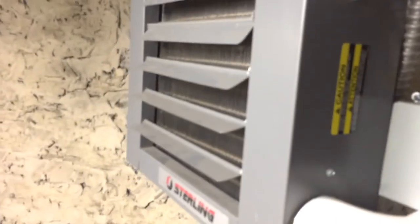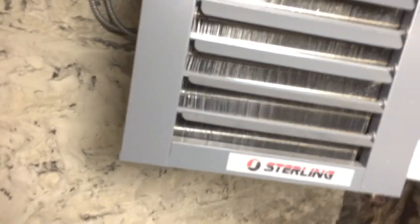This is our outside air intake — nice and open. There's a unit heater up here; it really doesn't need it up here, but it's kicking on. It'll start blowing off some heat. Got a little zone valve there that opens up and it starts getting some heat out of it — nice little setup. That's only for when it's really, really cold.